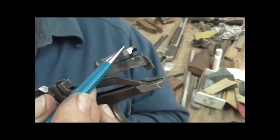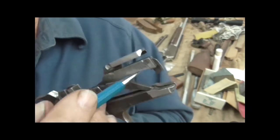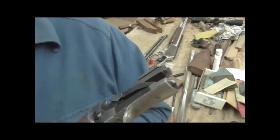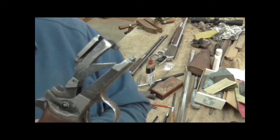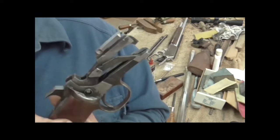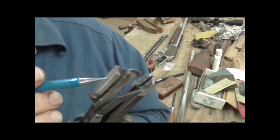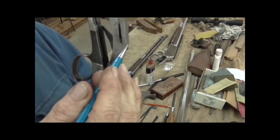The top part of this thing was missing — it was broken off right about there, just snapped off. Since I didn't have one to go by, I didn't know why it didn't work. We looked it up on eBay and he sent me a picture. I said, well, it's not going to be any more torn up if I mess with it. They were kind of pricey on eBay because I think it's a weak link — people assembling these takedown guns slip this piece in first and if they wiggle it around much, they snap it right off. It's just a very weak bit of metal holding it on.